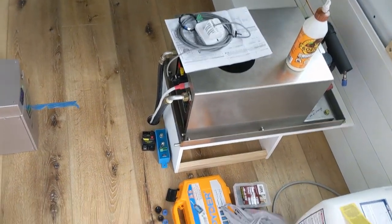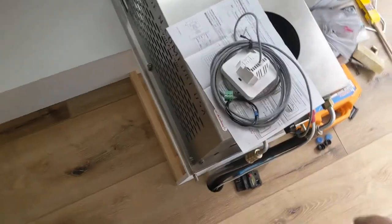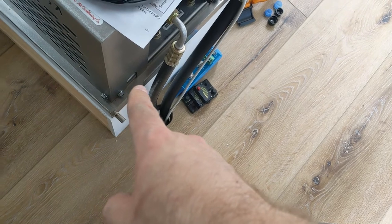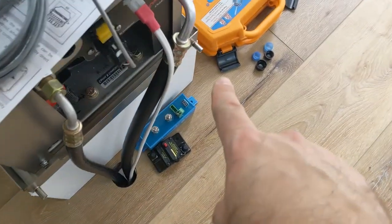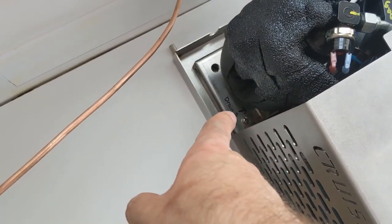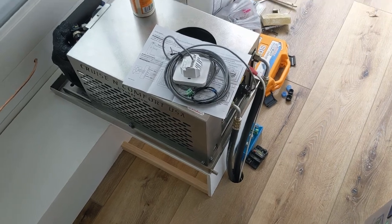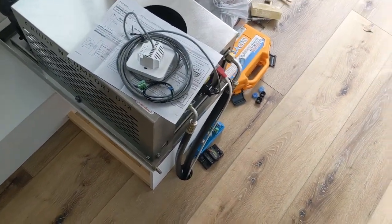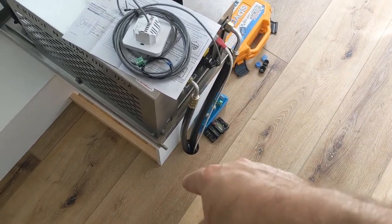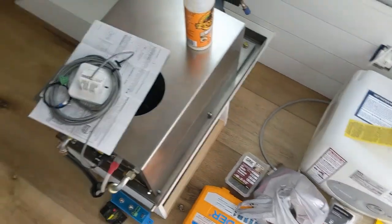I've got to go to the store and get some wire and the drip tray. There's a water condensation drip right there — one there and one there — and there's also another drain. It's supposed to come out here. I really didn't want to put six tube drains, but I have no choice. There should be enough room for them to all go down the same hole. Maybe I'll tie them together with some T-fittings — put two together with a T and have one line go down, and do the same thing in the back.